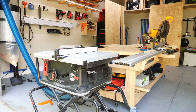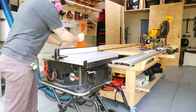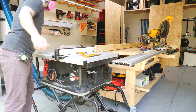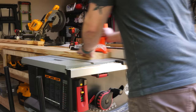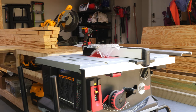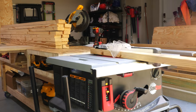With the design nailed down, I got to building the bench and I started by ripping some 2x8s down to get my 3-inch wide boards. The reason I went with ripped down 2x8s rather than just using 2x4s is that I wanted the sturdier southern yellow pine that 2x8s are made of here in the southeast, as opposed to the ultra soft white wood of which 2x4s are made. Ripping these boards down wasn't the easiest task as there was a ton of tension in them, but I eventually got them ripped down to a rough width of 3.25 inches.